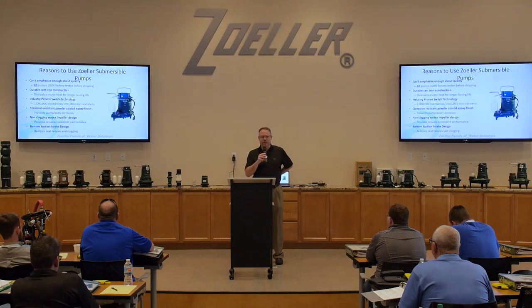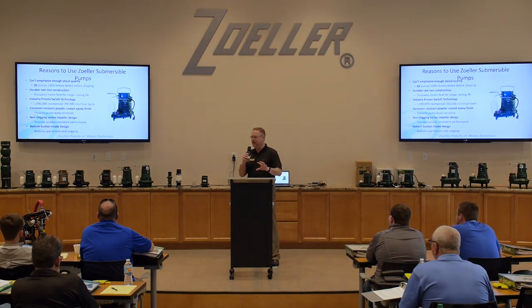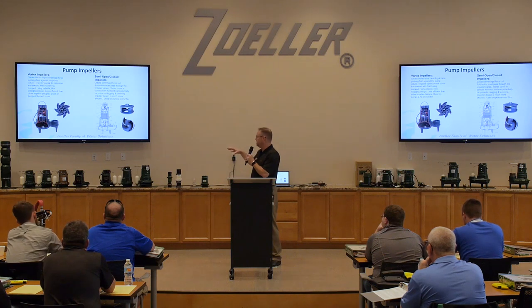So when you have a sump pump protecting your $50,000 investment that you just made in your basement, are you as concerned that maybe that pump can pump a little bit more, a little bit higher, or do you want that pump to not clog and jam and flood your basement? And that's the trade-off that we do use with vortex impellers. We'll take a little bit less performance for reliability, because we're really looking for the reliability side on a small sump pump. And we talked about the downside of a vortex impeller being that you do lose some efficiency.